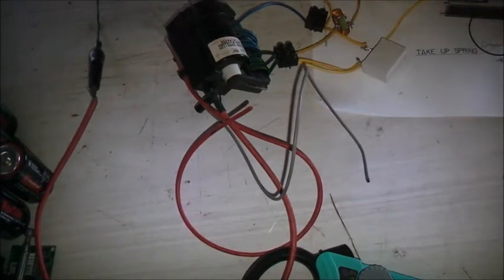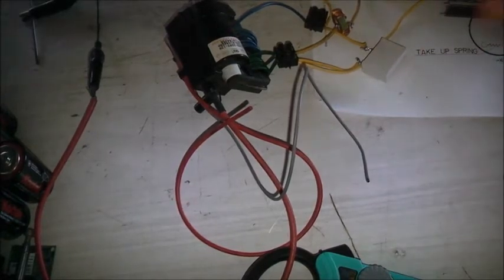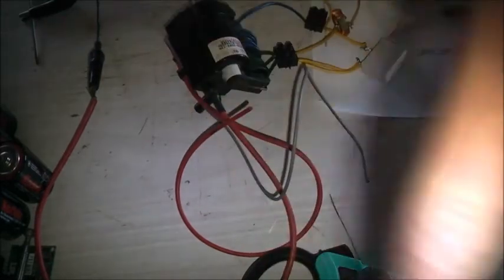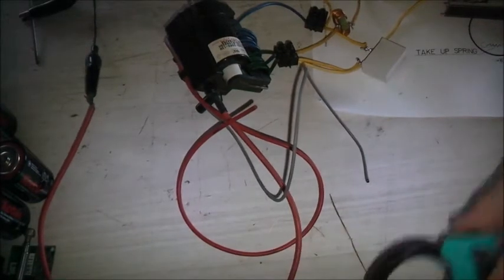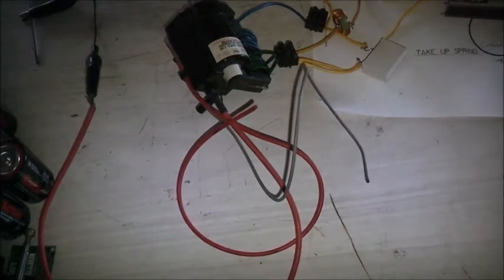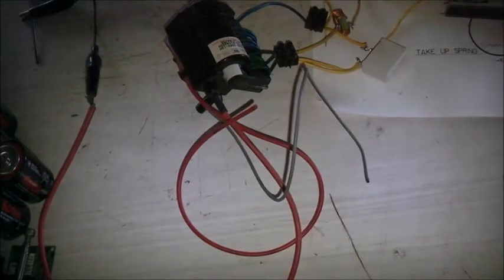Quite impressive. Well, it's arcing a little bit, but I think the hot glue's melting. It's arcing in the hot glue, not actually to the bottom of the body of the Flyback. As it arcs through, the hot glue's melting and quenching the arc, so as long as the hot glue gets destroyed, not the Flyback, that's not a worry. Anyway, it's quite a good little meter. Very handy. Good range on it too.